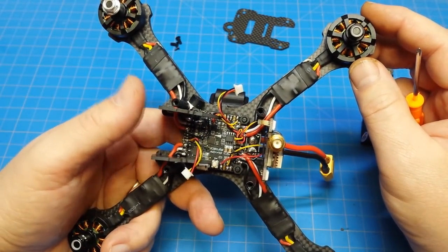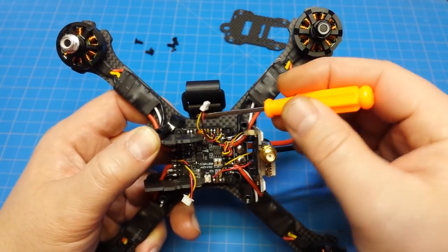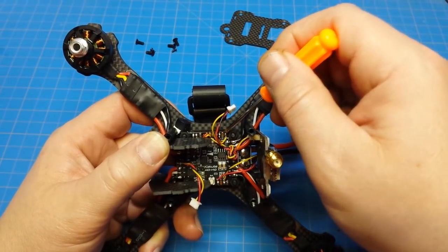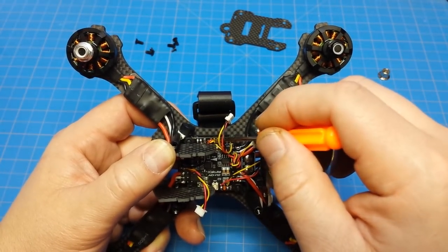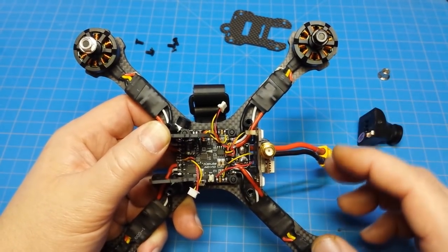Sticking my nose in here a little bit deeper, it looks like the lead they've planted for us is connected to 5 volts over here, SBUS right here, and then our 3.3 volt is this pad right here. So if you're going to do Spektrum, it's very likely you're going to need that, especially if you're using a little satellite. All right, let's put things back together and take a look at the firmware installed and the OSD.